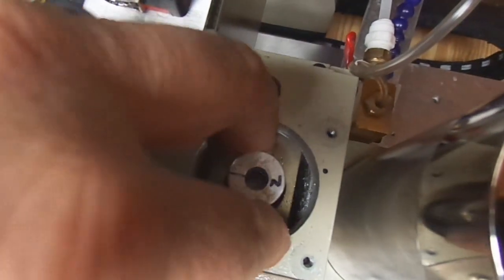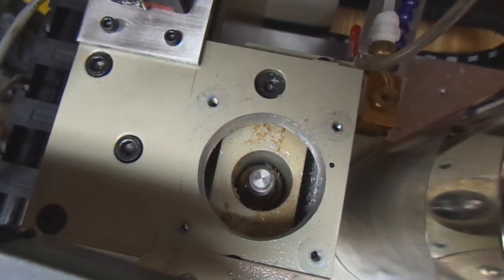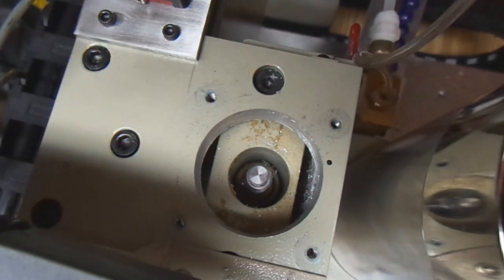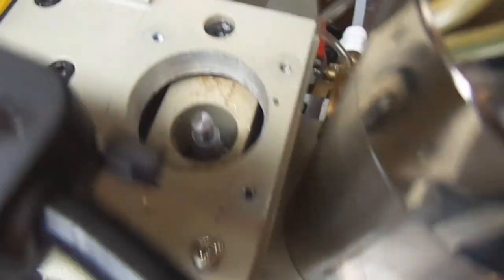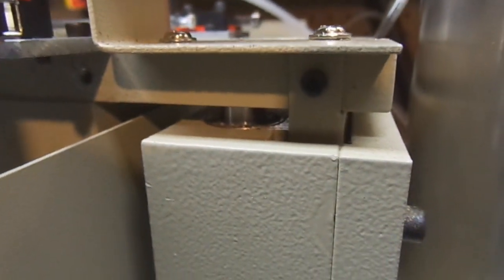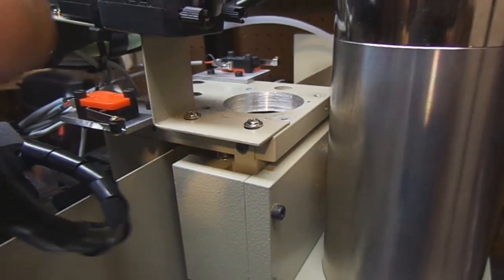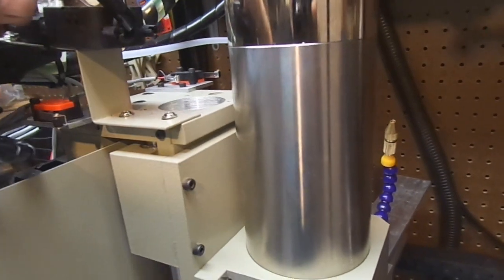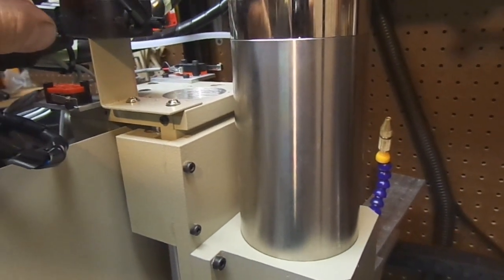If we can enlarge that hole to fit the new couplers, then you would regain your clearance back that you lost. But we still wouldn't solve our end play problem. So with this all the way up, you can see that we've regained our clearance back. So that's pretty important. So let's put the solid nut back in and put it all together. And then we're going to check our end play and see. I'm not expecting 0, but hopefully we're going to have less than 80 thou.